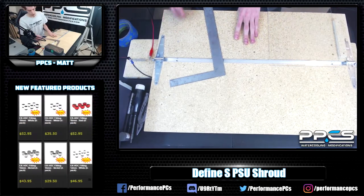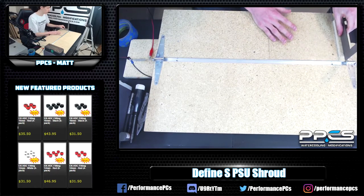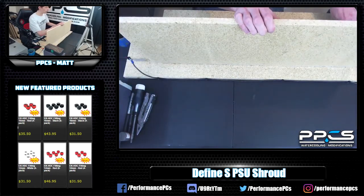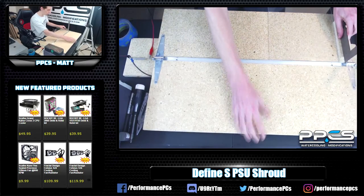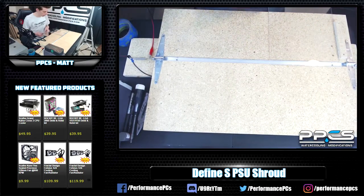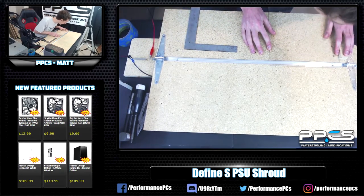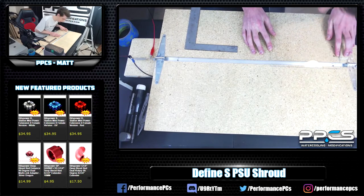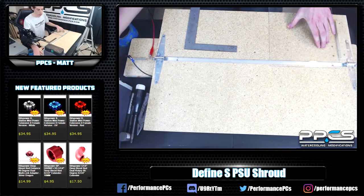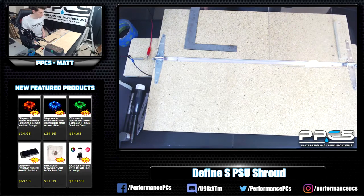Today I've got one of the benders I've actually made for Hank that we plan on selling. These are nearly done — I just need to make a guide for it, a block on dowels that you set on there so you can go all the way up to 90 degrees. Today we'll just use a square, which works perfectly fine for a decent bend. Make sure your wire is lined up with where you want to bend because that's pretty much exactly where it will bend. I'll go ahead and fire up the PSU — it takes a minute or two to heat up.